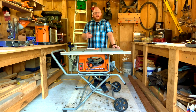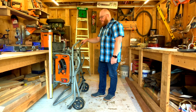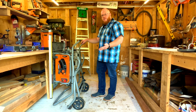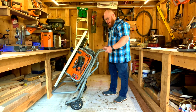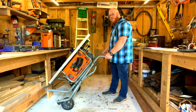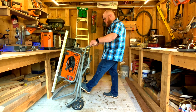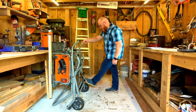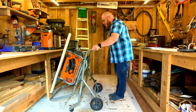Let's dive into the features. The first feature is the stand. For a smaller shop — the reason I bought this saw — you can maneuver it around just like a dolly. It has tires so you can wheel it wherever you want. Once you get to your spot, there's a foot lever that releases it from the lock; the wheels roll toward you and you just tip it down. The saw snaps upright very smoothly.